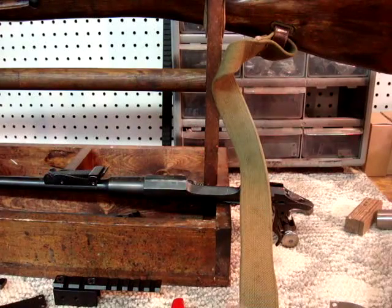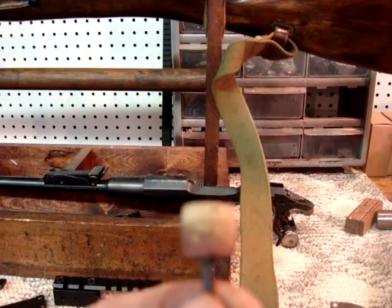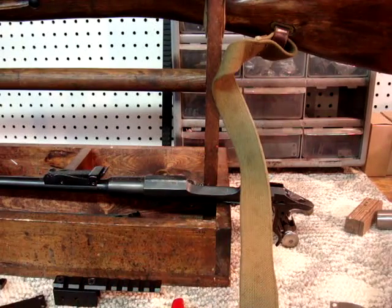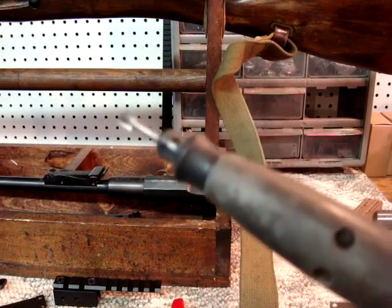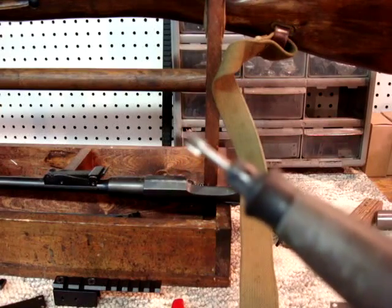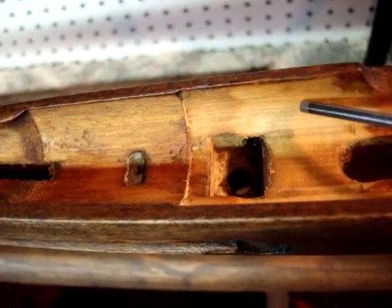What I used to do that is a Dremel sanding wheel, about a 5/8 inch sanding wheel, and I have a Dremel attachment that I do that with. And so I'll mount that wheel on there, and then I stick it in this area here, and I round it out until I've got enough out. Now you can generally stop your inletting about a 1/4 inch from the top.